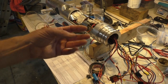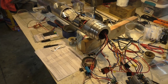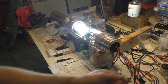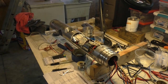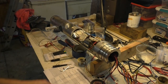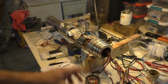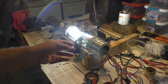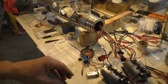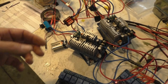Now they're making LEDs with just one big element in the center, which will be beautiful if you want to put a focusing lens over it. These are supposed to be 1000 lumen — I doubt it because they came secondhand from China, probably Cree seconds and thirds. But now they have LEDs doing 1000 or 2000 lumens. I don't know if I can drive the new ones from these modules — the drivers take 12V DC in and put out 34.5V DC, which has something to do with constant current.